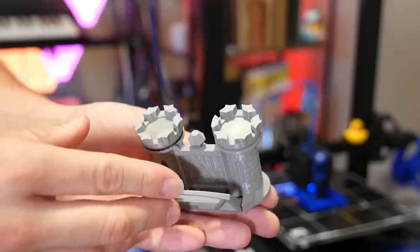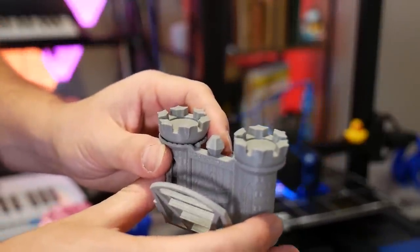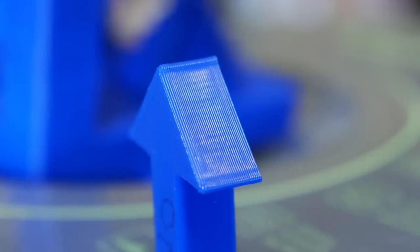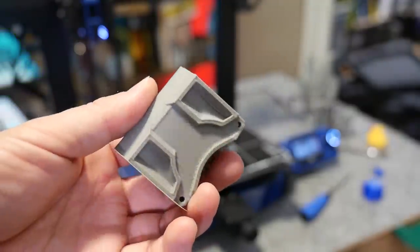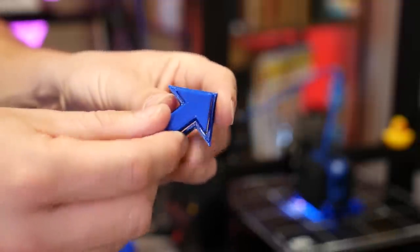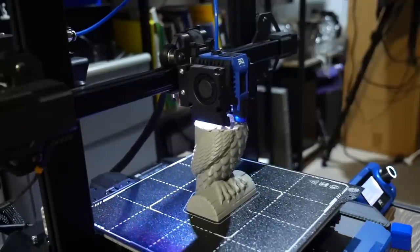When I started printing more complex test models like my clearance castle, I was disappointed to discover that the portcullis is completely fused in place. I printed this tiny arrow to demonstrate the issue — on all of these prints, when there's a hard sharp edge it's bulging quite a lot. You can see it really clearly on this print that holds the optional accelerometer board. These bulging corners destroy print accuracy because there's too much filament coming out at a given time and the printer's not controlling it enough with this Bowden style setup. Thankfully we can do something about it.